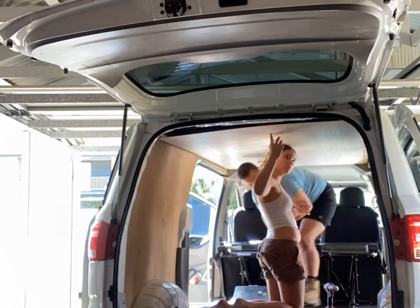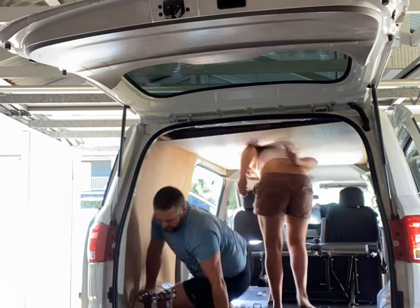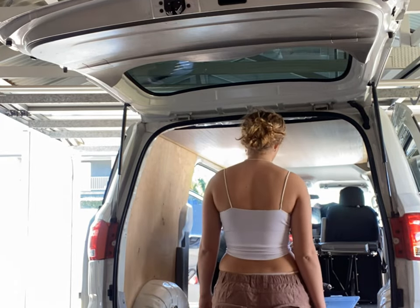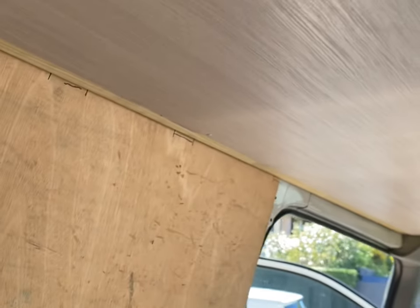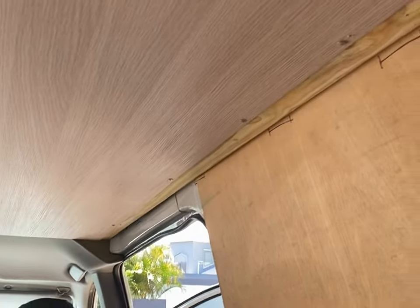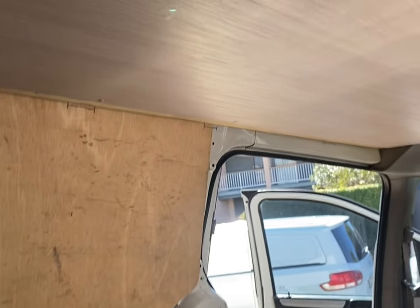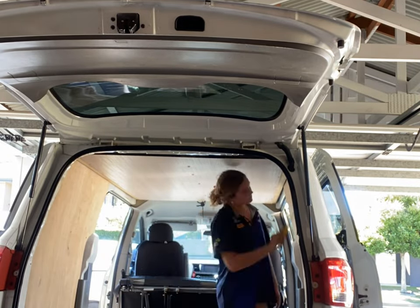Here we have pushed the melamine up to center, ensuring there is the same amount of gap on either side, as we're hoping to do a nice white skirting along it, covering up all the mess and the raw timber hidden behind it, along with those screws. We did fewer center screws as we wanted to hide them, so we just used snap-on screw caps — put the back on, screwed it in, and snapped the cap on to cover them and make them look a lot neater.